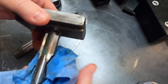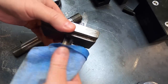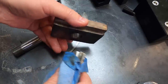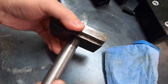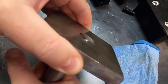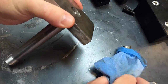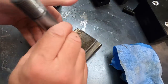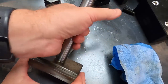You do not want your stud to protrude from the bottom of your T-nut. What will happen is the stud will go through the bottom of the T-nut and press the T-nut into the top of your compound, and it will crack the top of your compound. So I basically just ran the tap in through a couple of turns beyond flush — by not tapping it all the way through, the stud stops right there. I'm not going to get in a situation where I run the stud through the bottom of the T-nut and damage my compound. Many a compound have been broken that way.